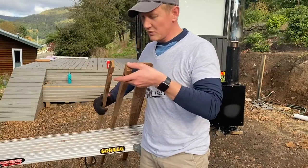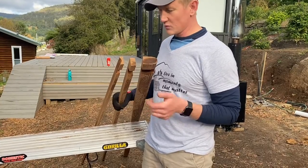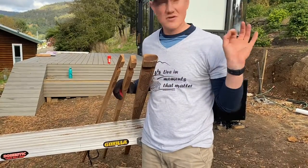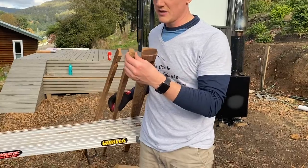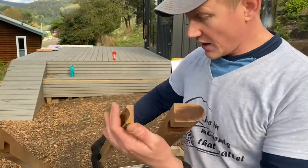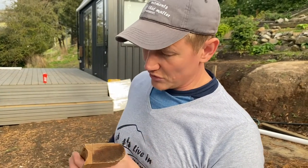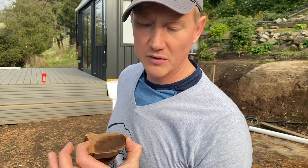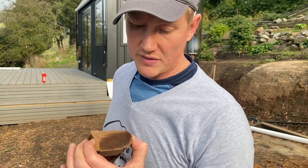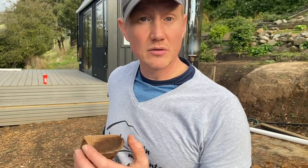We had to split one stave into three pieces. We measured and found it was exactly 25mm excess. We cut this piece out and joined the two remaining pieces, so the modified stave is now 25mm smaller. This stave now fits nicely and we continue with our assembly.